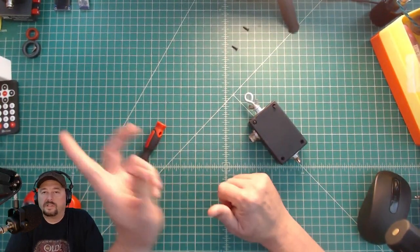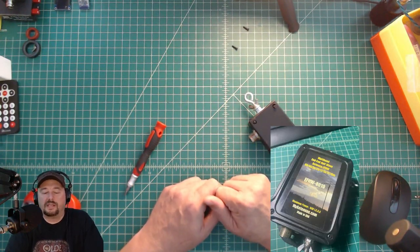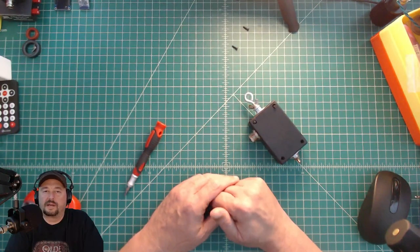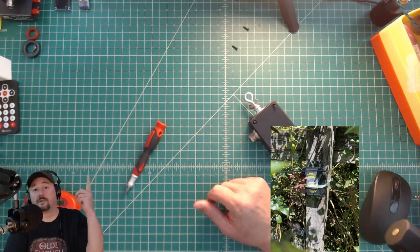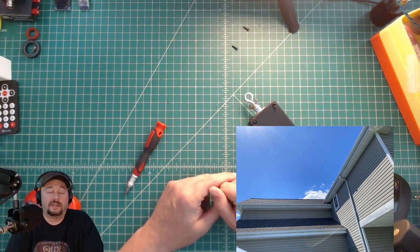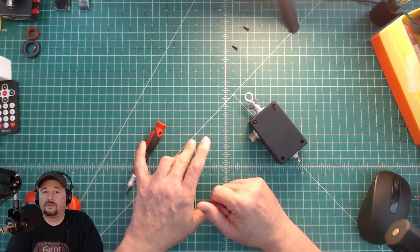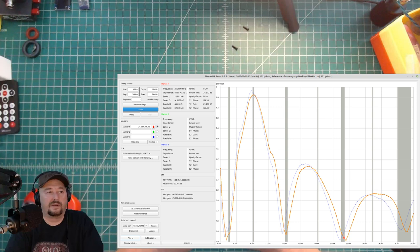Now I'm going to roll in some pictures of the antenna I use the most — my long-term antenna, which is an EFED half-wave I got from a good buddy, Chuck, KK6USY. Check out his YouTube channel if you're not subscribed. I have a 66-foot element mounted so that it actually runs right over the roof where I'm sitting — I'm in a loft above my garage — going from the backyard over the roof. It works extremely well, tunes on 40, 30, 20, and 10 meters, and here's a clip of me using it with the NanoVNA.